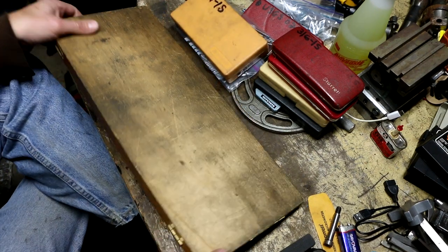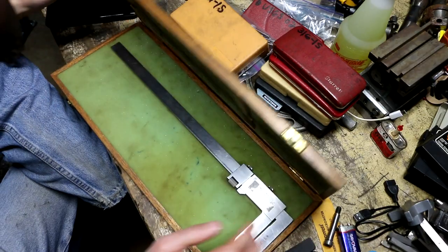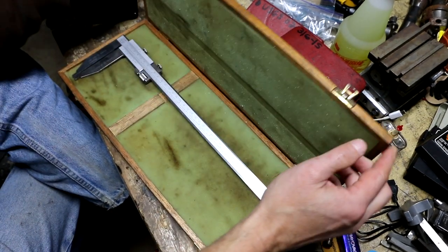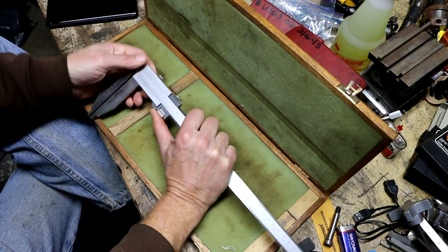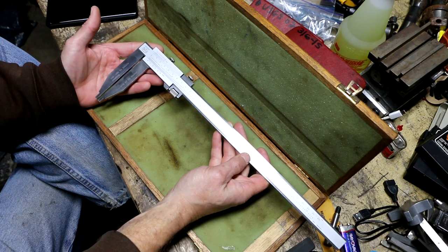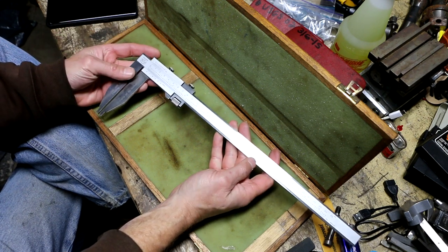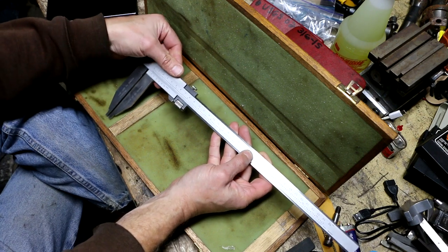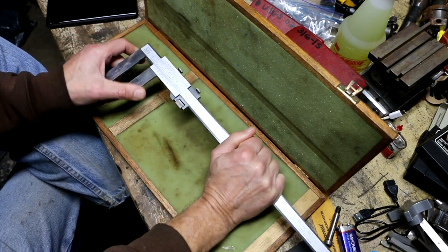The reason I decided to go out there was because some of the stuff in the photo were nice specialty mics. Let's start with this - a Helios, made in Germany, vernier caliper. Vernier calipers don't normally bring as much money because a lot of guys don't want to use verniers anymore. This person worked in a machine shop inspection setting and followed the general advice of not storing your calipers or micrometers in the closed position, so there's an air gap left. We can loosen this up to make sure it works - it is nice and smooth.